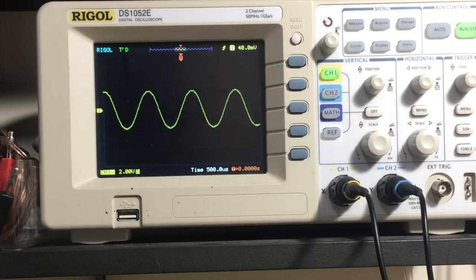There. I think I've just adjusted that to as close to fidelity as I can. That's my 600 hertz signal that I modulated on that FM carrier. And I think we've actually adjusted the whole thing, and we should get a much better result when we test the FM. Let's have a look.